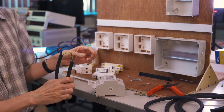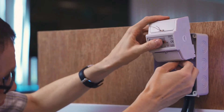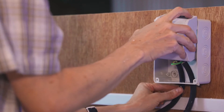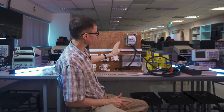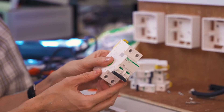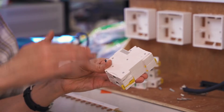I'm going to wire up our electrical meter according to the wiring diagram. It's spring-loaded on the back and attaches to a rail called a DIN rail. We have our electricity meter now clamped down to our box, with one cable coming from the utility company and another carrying earth, ground, and neutral running into our circuit breaker box. The first circuit breaker I'll be installing is the main switch — usually a two-pole circuit breaker that switches off both hot and neutral in a fault. I'm going to run the line in from the bottom and the load out from the top.